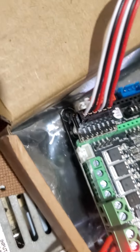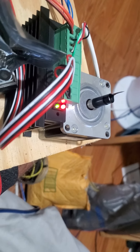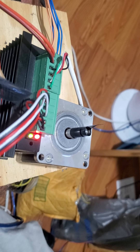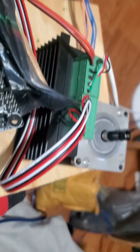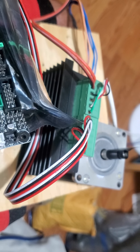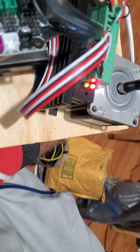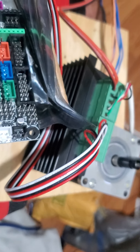We're on the X-axis down here in the corner. I'm going to try to move 10 — I don't know if it's positive, clockwise, or counter-clockwise — but if it did spin you would be able to see it doing something. I don't see it doing anything. I'll try going left, try one millimeter. Still not doing anything. I'm not sure exactly what's going on, but it's not working.